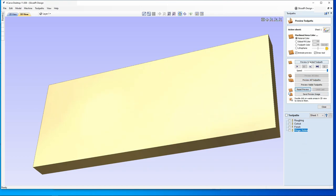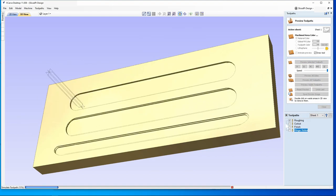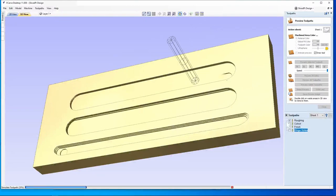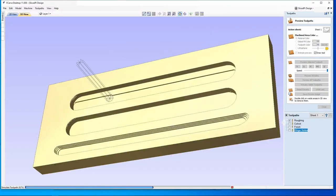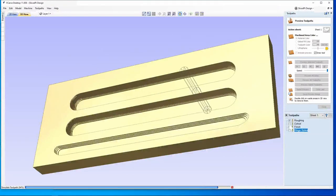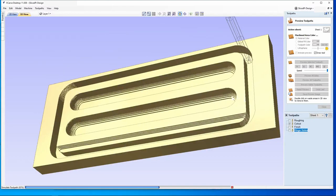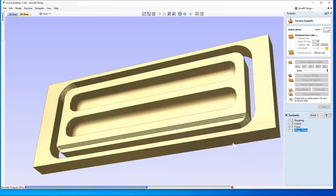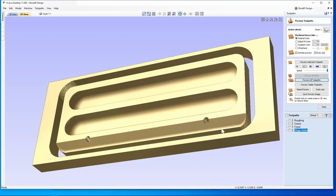And if I play all the toolpaths here, you can see it does the roughing cut the way we expect it to, and gouges out those slots down to, they're about 9 millimeters deep coming from Fusion. And again, you could create these in V-carve as well. You might actually even get a little better job, but I don't care about the smoothness here because I'm going to put felt inside.